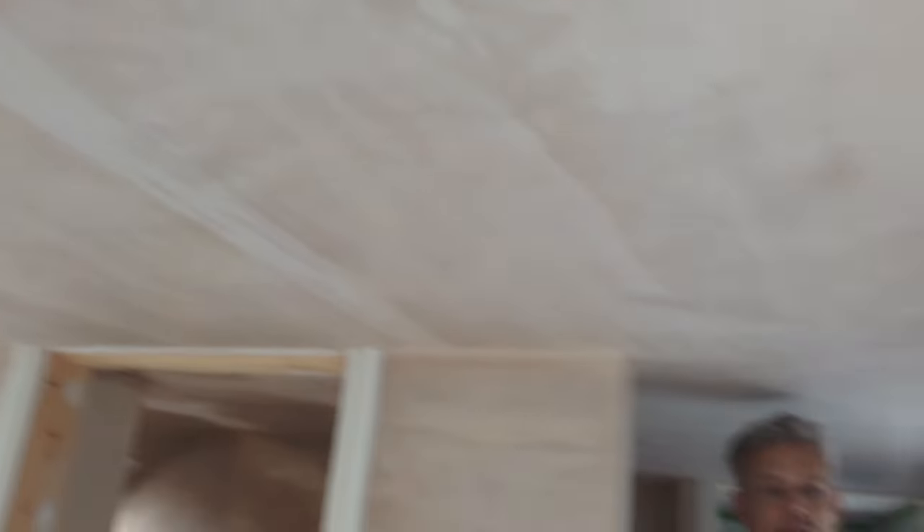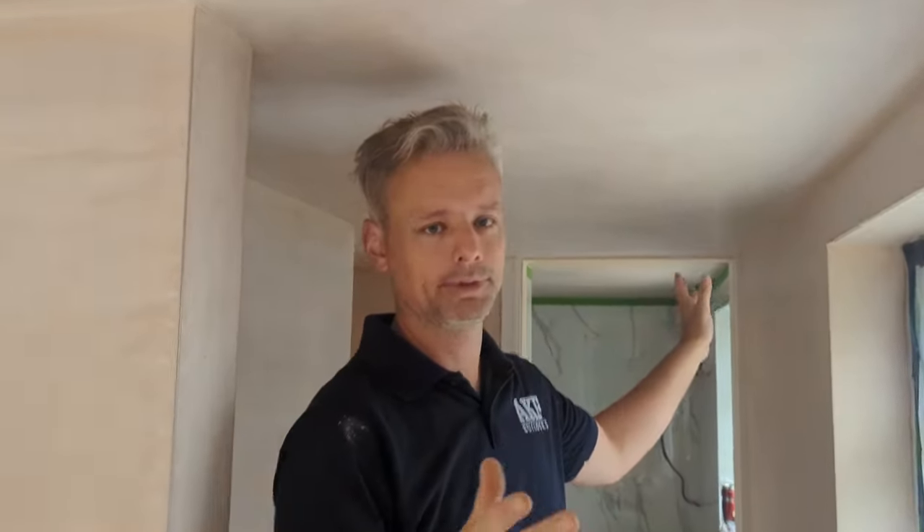So we're going to put you on time-lapse and we're going to find them. We've marked them, as you can see — we've used a laser level to set them all out. There's 16 in this room plus the fan, so there's 17 holes to drill. We might not drill the fan position purely because it can only be in one place; we can't get that wrong — it's impossible. Famous last words.